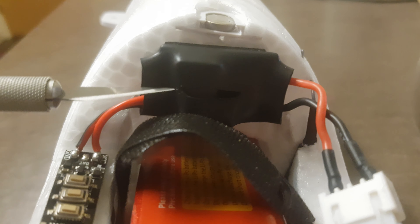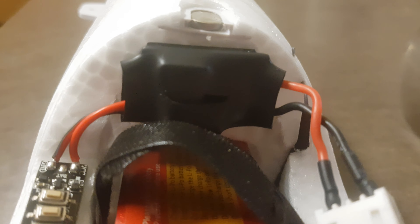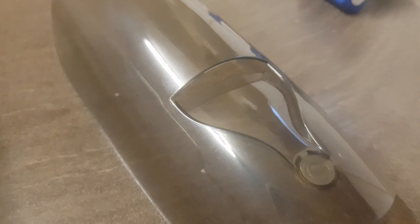So what I've also done was take my scalpel - or as people call it, an exacto knife - and cut a little vent into it. Literally just poke it in, not too high, get a slit in there, and then cut the rest of the slit out. Don't touch anything inside - just try and keep the tip of the blade in there. It can be a bit difficult if you're not used to cutting stuff out, but well worth getting a bit more heat out of that thing because you don't want heat building up in the canopy, although the existing vents are a good concept.